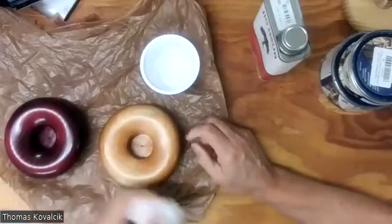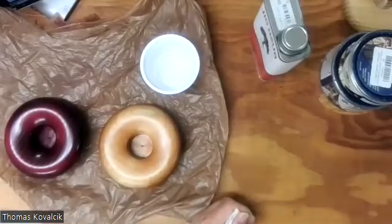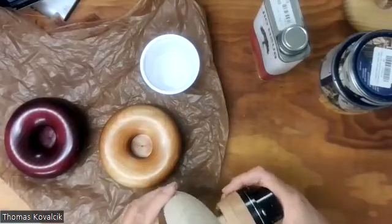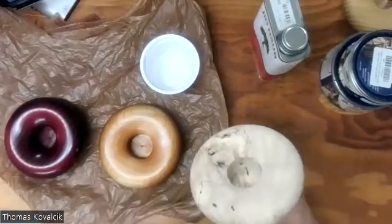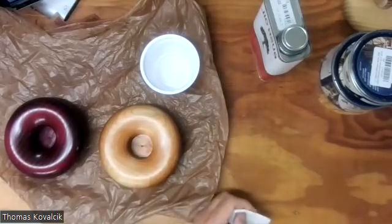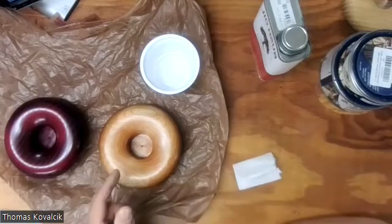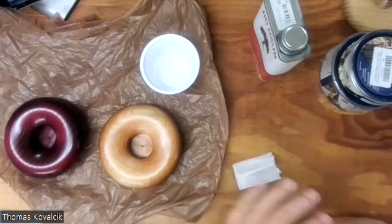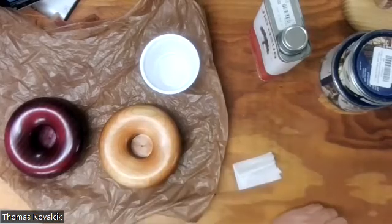Sometimes you got to put a lot of oil. With this maple, I wouldn't call it punky, but it's soft and it soaks up a lot of oil. So you got to sit there and keep an eye on it. Just keep it wet is the point. I'll put on a coat and let it dry for about 15 minutes. And then I wipe off the excess.